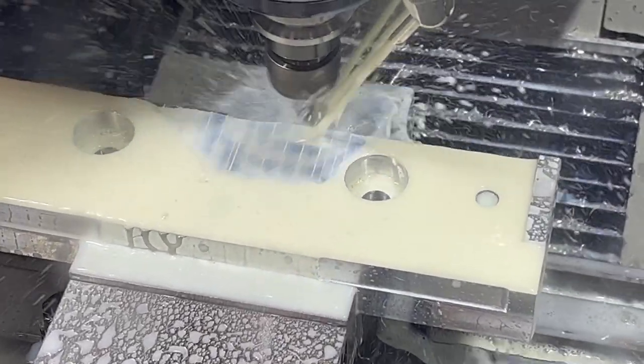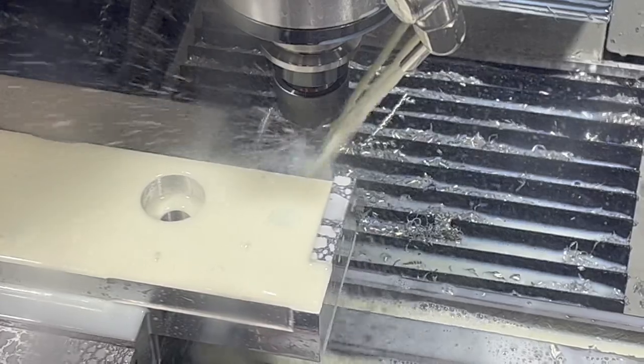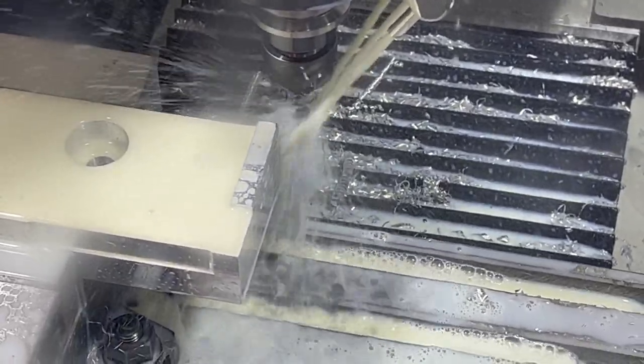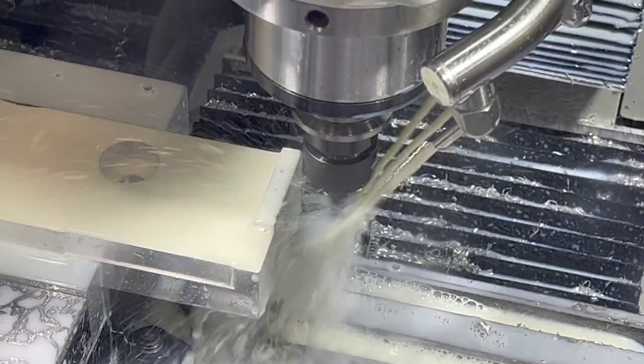And it's working on going around the edge, but man, for some reason, it doesn't seem to like this pull. 3/4 inch depth of cut there, but yeah, we'll let it ride. We'll see how it goes. I will definitely put a new cutter on before I get one of these 4140 pieces in there. We'll start with a fresh 3/8 bit, see how it goes.